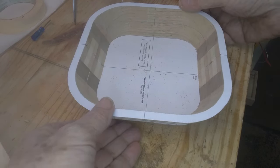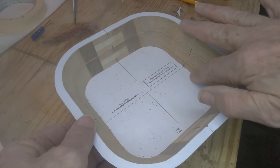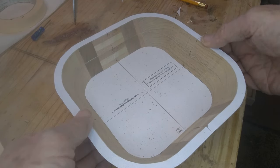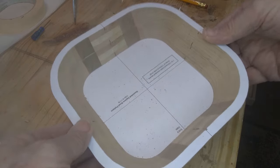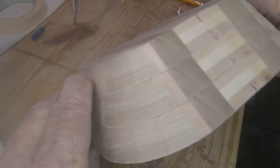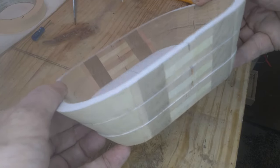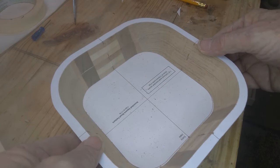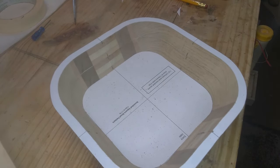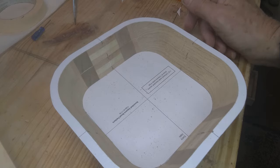And again, I have it at the bench, marking the second ring, the bottom one there. And again, it's fitting the pattern very nicely, so I'm obviously cutting it fairly accurately and the angle is right. It's looking good on the outside. There's not going to be a lot of sanding. The grill marks will be the biggest thing to sand, which I think is the way it should be. So I've got one more hole to drill and one more cut to make, and we'll have all the rings cut out and it'll just be a matter of gluing and sanding.